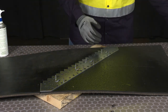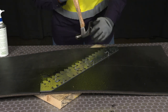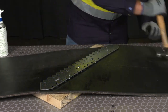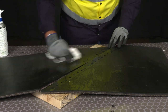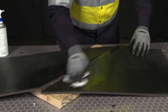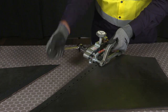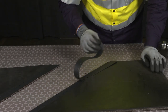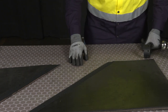After punching the holes, we're going to remove the template by removing the nails. And we're going to dry the belt so it's easier to skive. The benefits of skiving is to countersink the splice for better cleaner compatibility and a longer lasting splice.